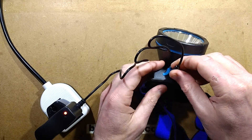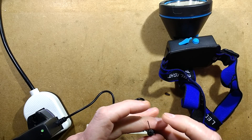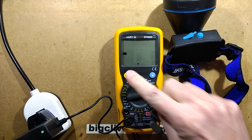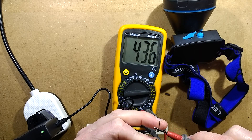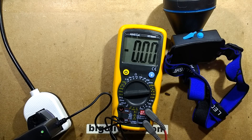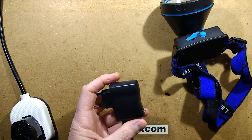The batteries in here probably don't have any over-voltage protection. If you stuff a bit of wire down the end of this — I don't necessarily recommend that on random Chinese products — and bring in the meter set to volts, this is the voltage that will charge the batteries up to if there's no protection. It just seems to be made really cheaply — some sort of simple resistive circuit with resistors that set the rough voltage level. These are very common cheap chargers and you can buy them on their own.